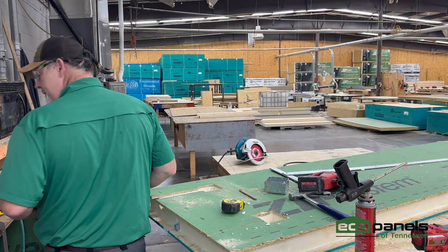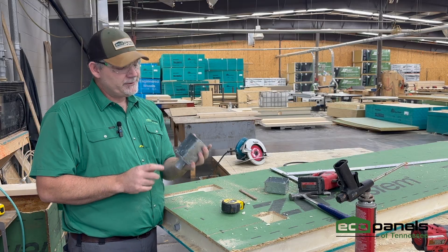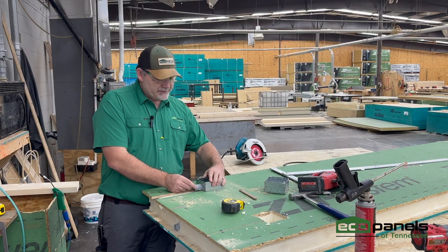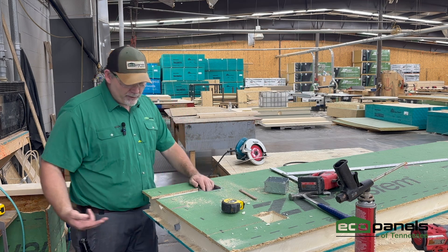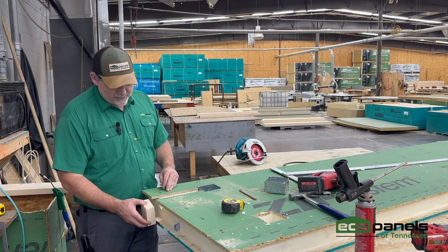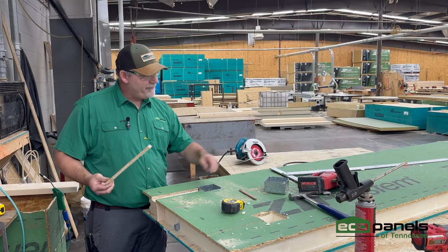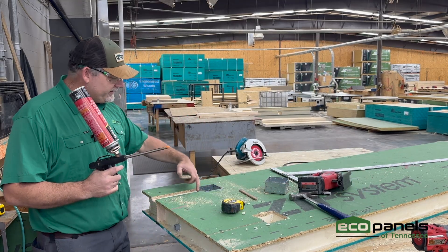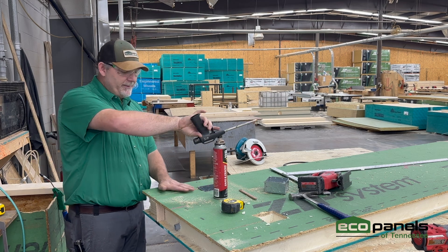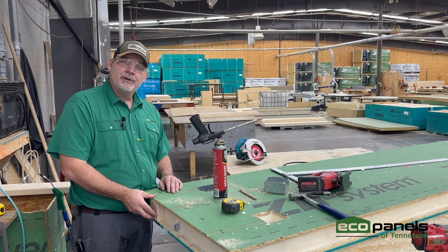Over here is one that we've got that's already ready to go. Just have to go to any of your electricians to know what to get. This is just a four-by-four standard box — it's got your male three-quarter inch and your female adapter here. This one's already cut out and dug out, it just slides in flush. I'm going to run my wire up from the bottom, run it in here, and the wire's going to come out in the box. Your base plate's going to be here — here's the cover we had for it. After I fill that full of foam, wire's in, everything's dug out, I'm going to fill it all with foam, stick this right on top — it should come up pretty flush. Put zip tape on both sides after it's dry, and you've got your smoker plug. You're ready to rock. Thank you for watching.